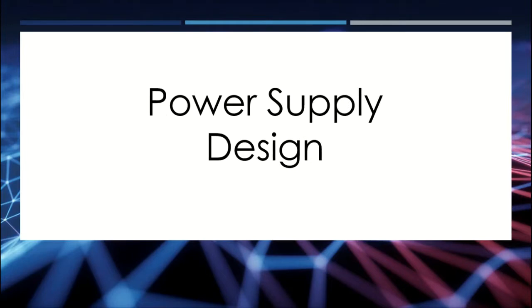All right, so let's get quickly into this. Before we actually go to using the Lazy Susan, I need to create, or come up with, a power supply design. Remember, we have two different parts of the circuit that need power. We need to power a digital part, which is going to need 5 volts, and then we need to power a motor, which is going to need at least somewhere in the range of 8 volts, from what I remember.